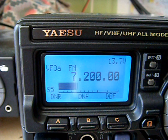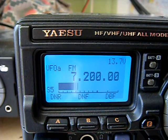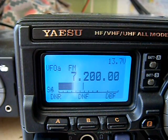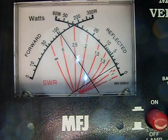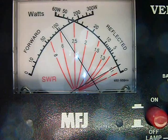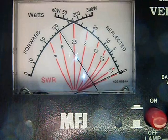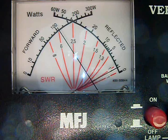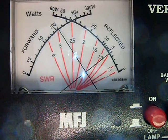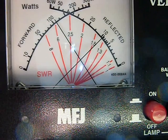In this bit of the video I'll be scrolling from the top of the 40m band to the bottom of the 40m band while we keep an eye on the SWR on the tuner there. We're now at the top of the band, scrolling down. The top of the band is at 1.2 maybe, and we hit exactly 1.2, now going down and we finish off at 7.000 so it's just over 1.3.